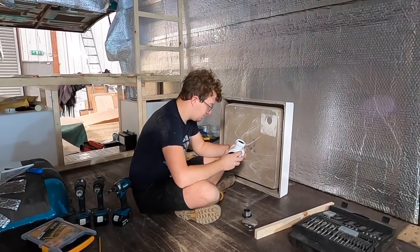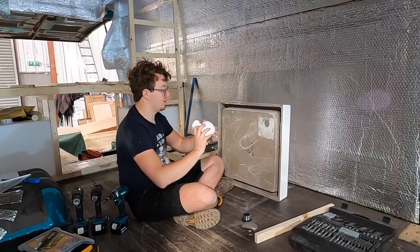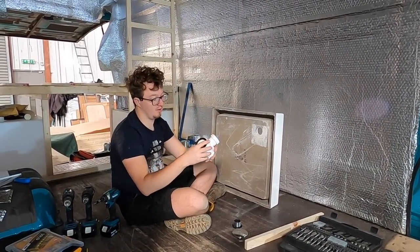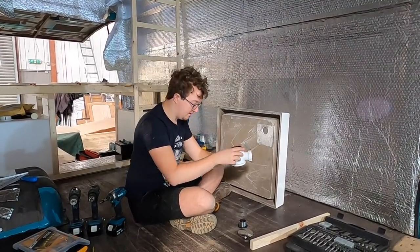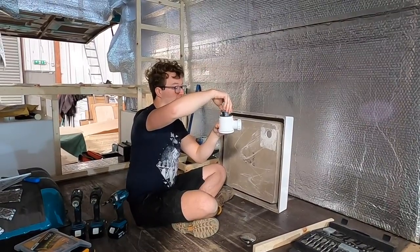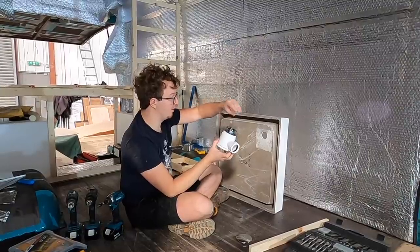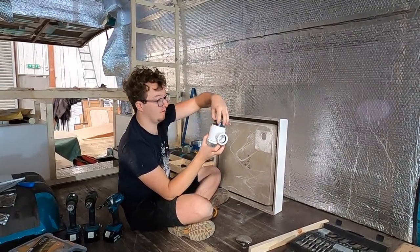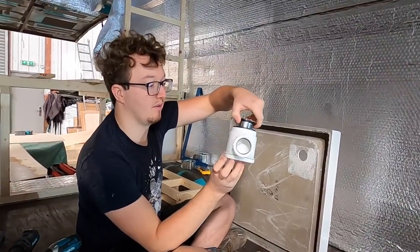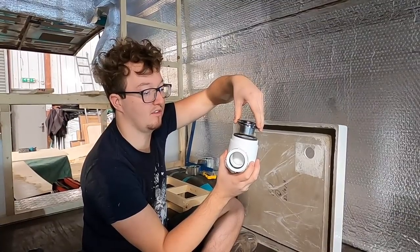What have you figured out, Max? Sure. Oh, I broke it. So this shower trap that came with our shower tray, obviously works, has a compression fitting on the end for like a household domestic waste pipe. This top section obviously kind of screws and sandwiches in the shower tray, which normally has a bit of a gap underneath it in your house, but because we're going through this and the floor, that's about as deep as it goes and that isn't wide enough, so we need something with like a longer thread to attach it about that height to sandwich it in place.